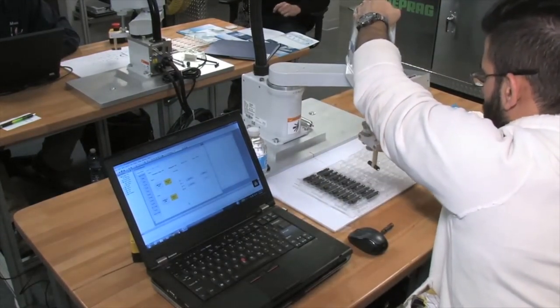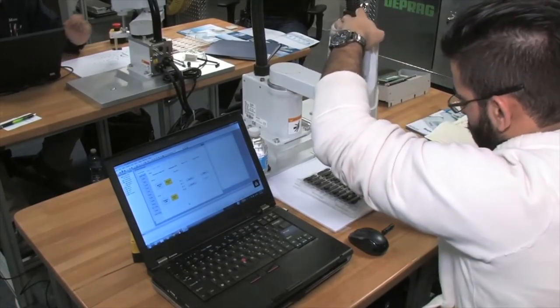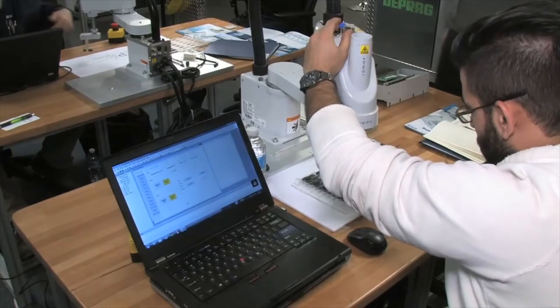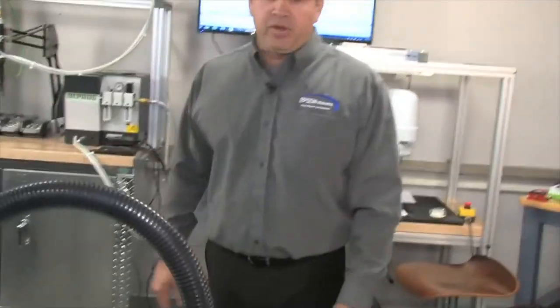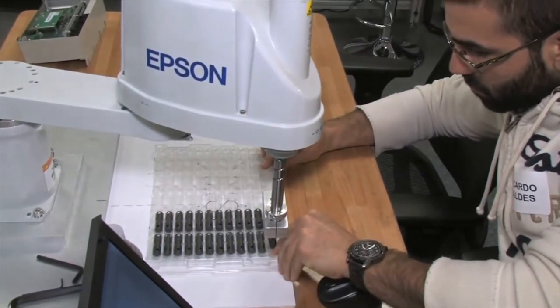And then teach a conveyor drop location. So let's say you're picking it up, then I drop off the part. Look at that. So the way you teach it, the T1, T2, T3, defines how it progresses through the pallet. In your help, you'll see, again, if you go to help, pallet, and then example, it'll show you how it progresses through the pallet. Now I'm going to come around and look at your code and see that you've got the right code in there.